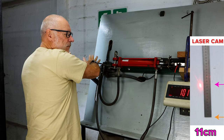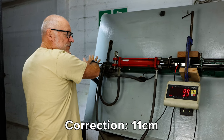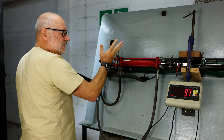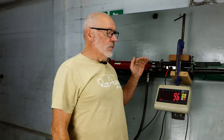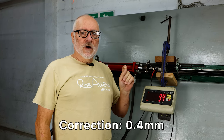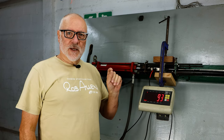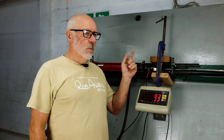So that would be how much power you'd get from two bands. You can see there's about 12 centimeters of change in position for the laser dot. Quite simply, not really suitable for that much power. We don't use these, but it just goes to show how much the wall thickness can play a part.